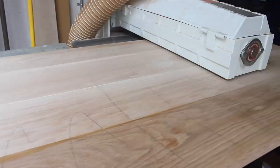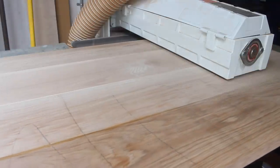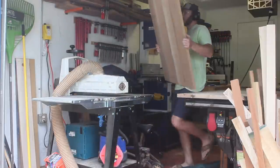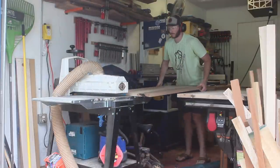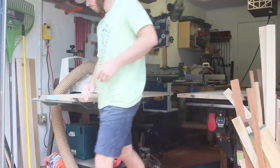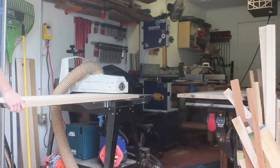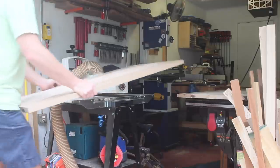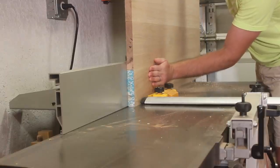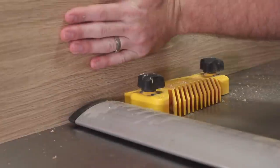In total, there were 4 large panels. I brought them down to final thickness at the drum sander. My drum sander is 22 inches wide, but open-ended. That means I can run these panels through once, flip it around, run it through again, and have the whole face sanded smooth. The only downside to this is how long it takes. With 4 panels and each face requiring at least 2 passes, square the denominator and carry the 1, I probably spent 2 hours moving these things around.